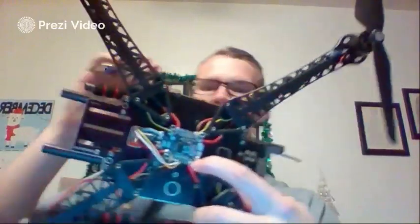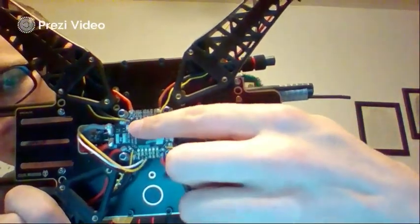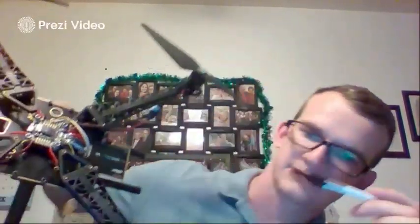As we're going to come in here, and when you look, in every corner, you can see my yellow wire is connected on the same node all the way around. That's what we're going to proceed to solder next. We're going to then connect our signal wire to that S pad. It's going to be the one on the left-hand side of that nut near your negative connector. So we're going to solder that yellow wire.